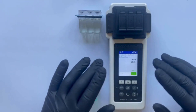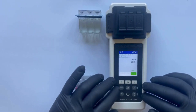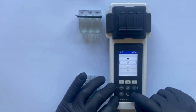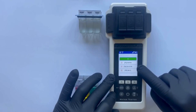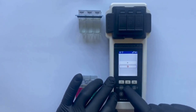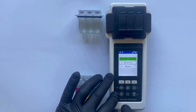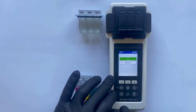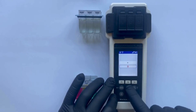Now that you have experimented and understood the settings, all settings should be returned to factory mode — here's how to do it. Press the 0 button to return to the previous menu, then press the menu button. Use the down button to scroll down and select settings. Press OK, then select pH, for example. Press the menu button and choose delete. The pH parameter has been reset to factory settings. In the same manner, select CYA, press menu, then choose delete. Next, select the last parameter, chlorine — press menu and again choose delete. The tester is now restored to factory settings.